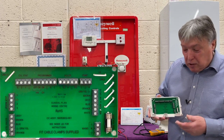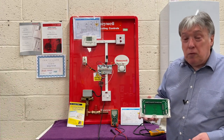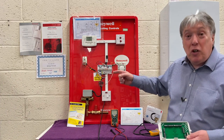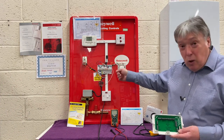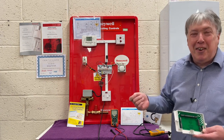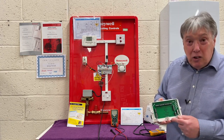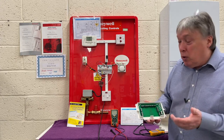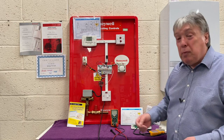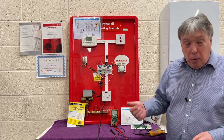The good thing about the wiring centre is it's easy to use. The downside is it costs £20, and installers won't spend that. They'll buy the cheaper one for £10, which is much harder for an amateur to do correctly. They try to skimp and make a mess. If you haven't been on a course, you will make mistakes — which is why we always recommend a wiring centre. Danfoss, Drayton, and Honeywell all have one, but for some reason many Honeywell installers say they'd rather spend £10 and make a mess than £20 and do it properly. I'll show you all the problems associated with that in the next video.